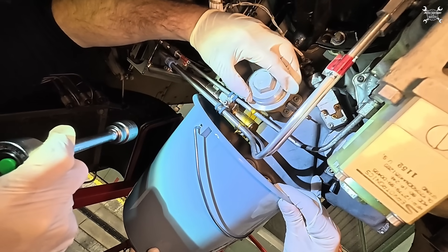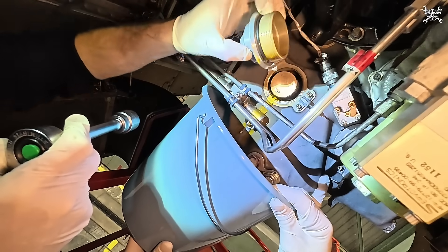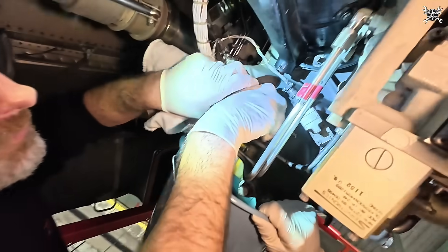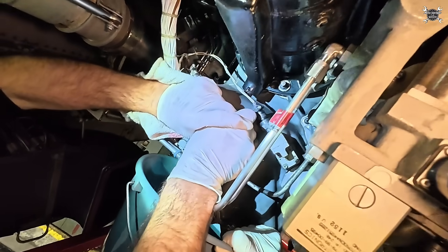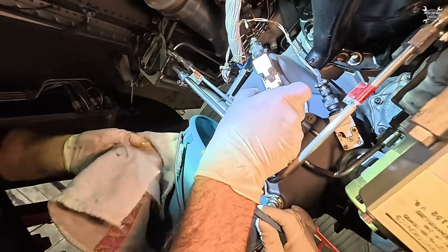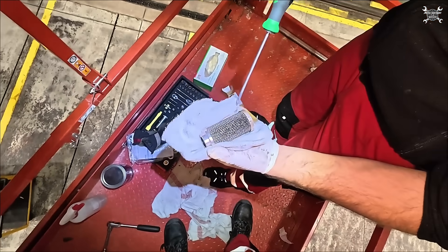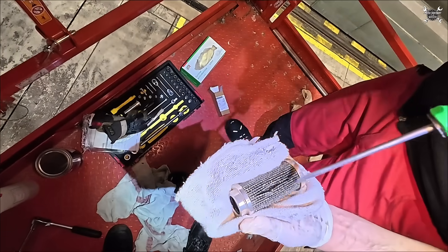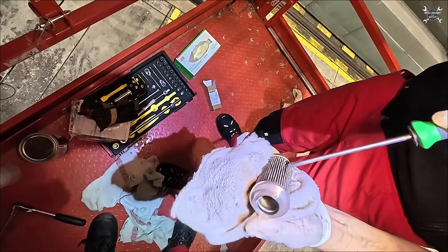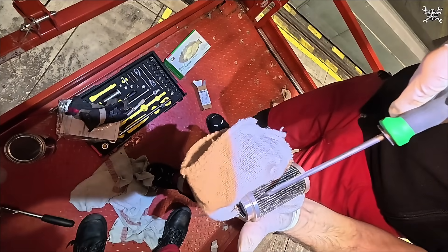It should not be that much. Give me a cup — holding it for you. Now pull the filter — I'm holding the back end so no spill. As a next step, we need to inspect the filter, which means we need to spread the ribs of the filter and look for any kind of particles or contamination, which can give us an indication that something is wrong with the APU or something is wearing off. In this case, everything was perfect.